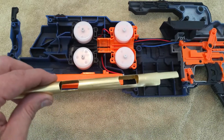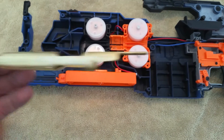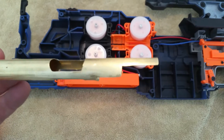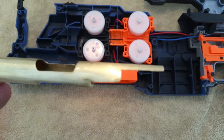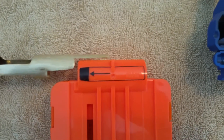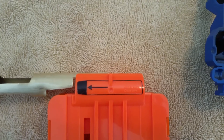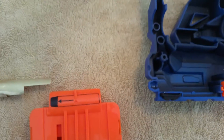This is the piece of brass that's been cut out for that. On the right side where it feeds in from the clip, I've notched out a slot for the clip to go in, and then notched it deeper. If we take a look at how that fits onto a clip, it goes in — that groove fits in here and then notches in there, catching the dart at the top and giving it a very good consistent feed.